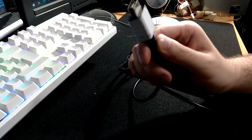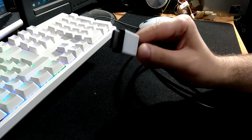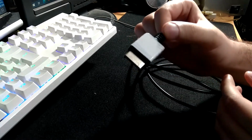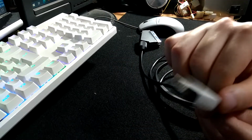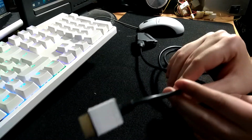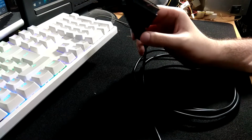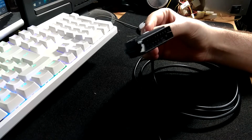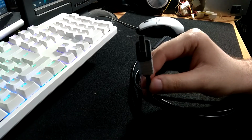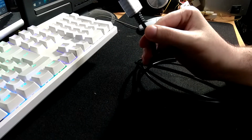3 to 4 USD. What I did was I opened up the connector, this one's a bit dirty, sorry about that, it's just sticky residue, and then I basically made this cable into a sync on Luma cable. What that means is all of these cables use composite as the sync signal. RGB requires the 3 color signals, red, green, blue, plus it requires an external sync as well. And the external sync is usually derived from the composite signal, which is not a very good quality solution, but, well, I don't know.